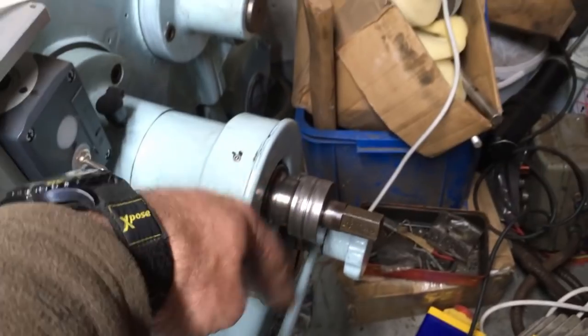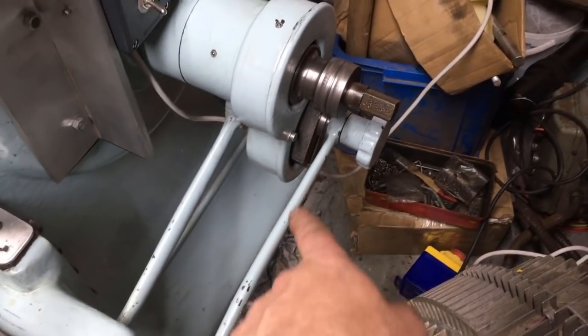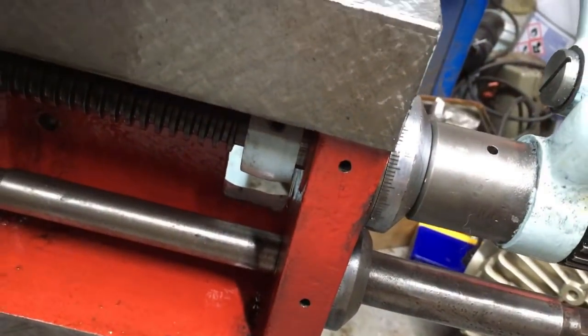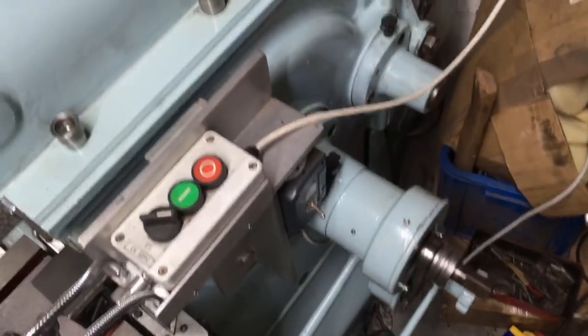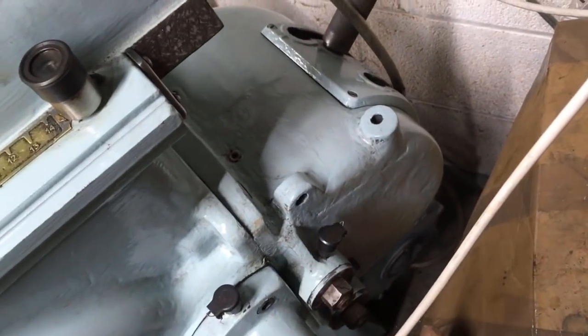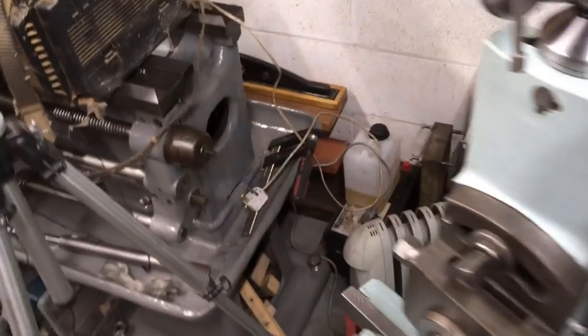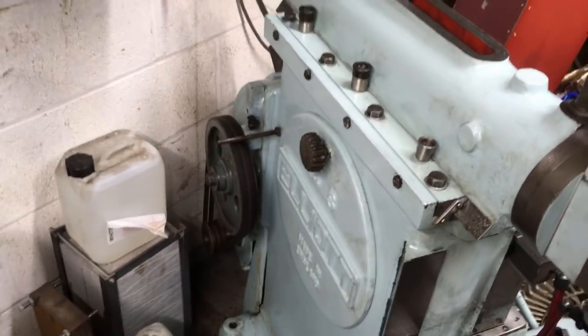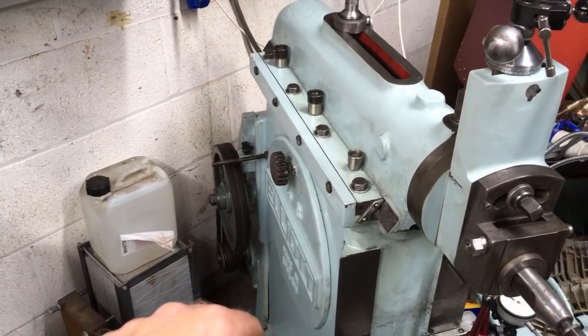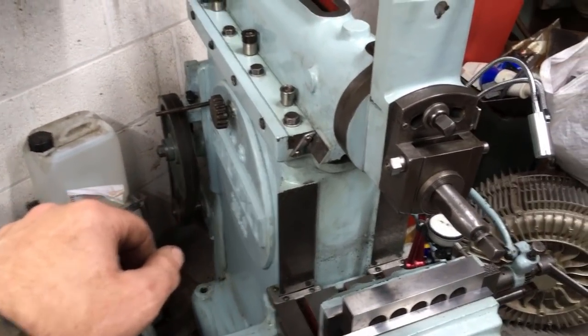So there's the ram wants doing, the main crank, the pivot for the crank, which allows the assembly to move backwards and forwards to allow the indexing, and then it's all the little tiny joints on the end of each shaft. I think there's 14 or 15 of them. Gearbox doesn't actually take that much. Some on the end of each shaft on the bearings, bushes, and same on t'other side. Then of course you open up the hatch and you have to manually lubricate the slider within the yoke. All that lot takes about 10 minutes, but if you don't do it, we all know what happens.